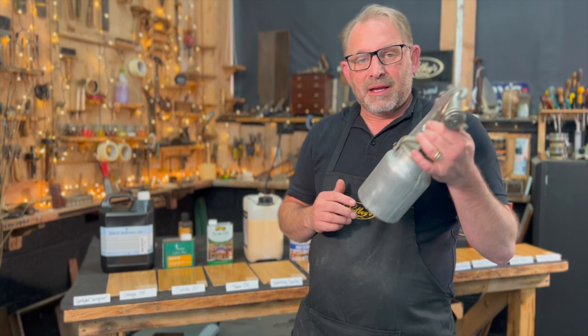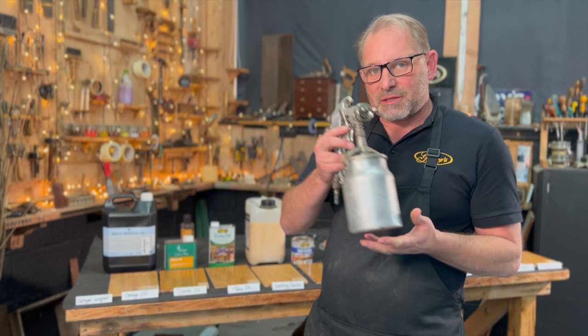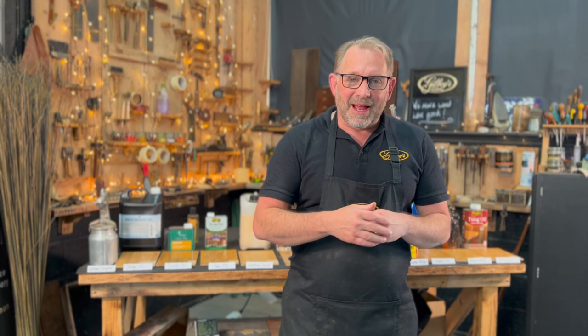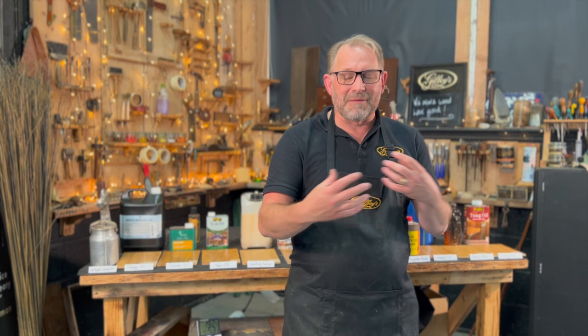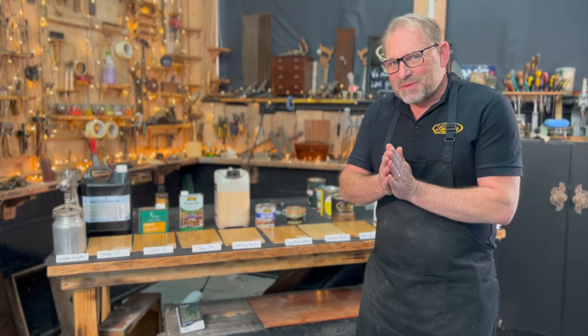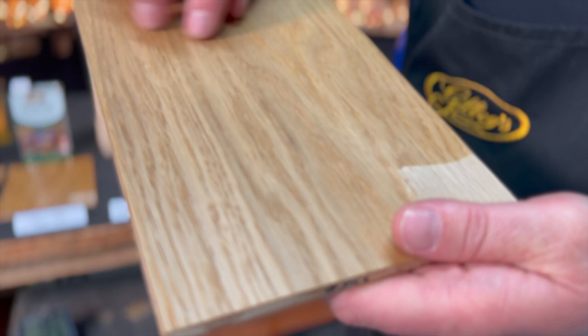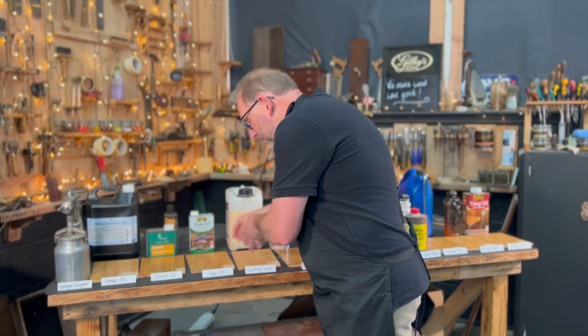So you've seen me apply all those varying finishes to the same piece of wood — oak veneered MDF. We'll come back tomorrow morning and carry on with the second coat and also talk about the properties and benefits of each one. Just before we go to filming tomorrow — you just saw me do the sanding sealer, and it's already ready to sand. That's only 15 minutes. The Danish oil is still very much wet, but the sanding sealer dries so quickly.